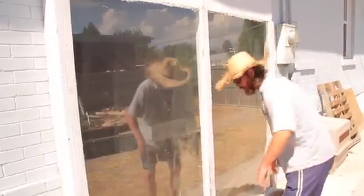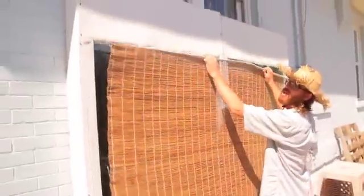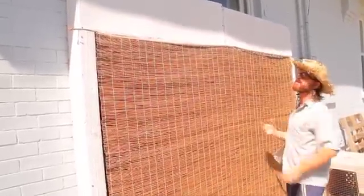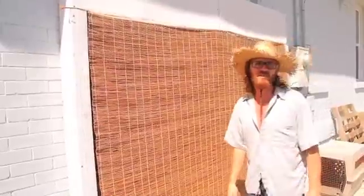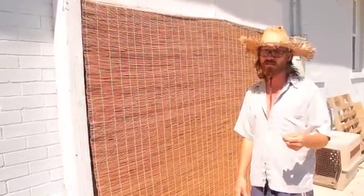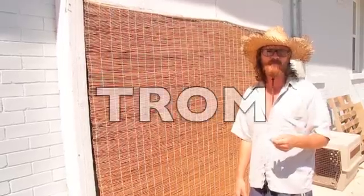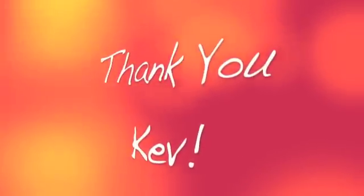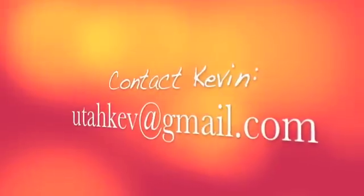I'm going to put this shade back up because it's summertime. You can also build these to act as a chimney that will actually draw the hot air out of your house — it's a slightly different design. If you want to look up Trombe walls online, it's someone's last name spelled T-R-O-M-B-E; just type it in and you'll get a Wikipedia page showing everything. That's a Trombe wall — I keep the furnace on as backup on cloudy days. You can heat your house for free using 100% salvage materials, like this one is.